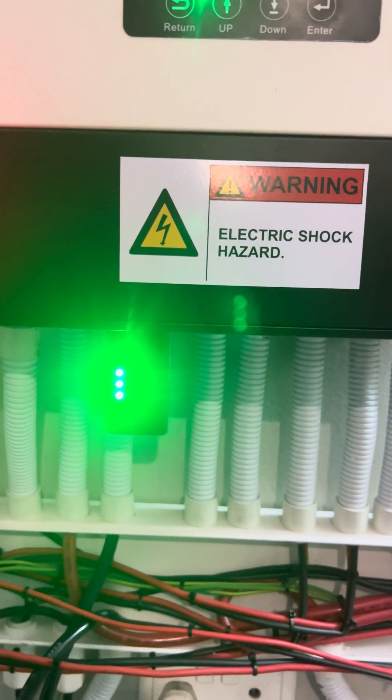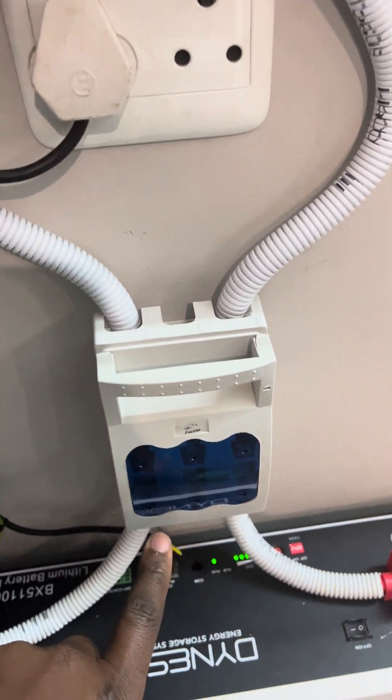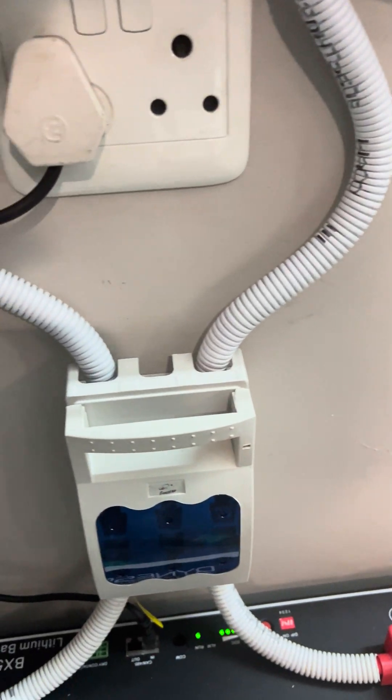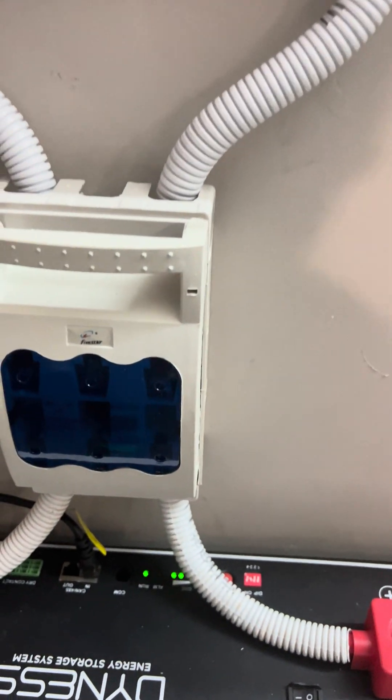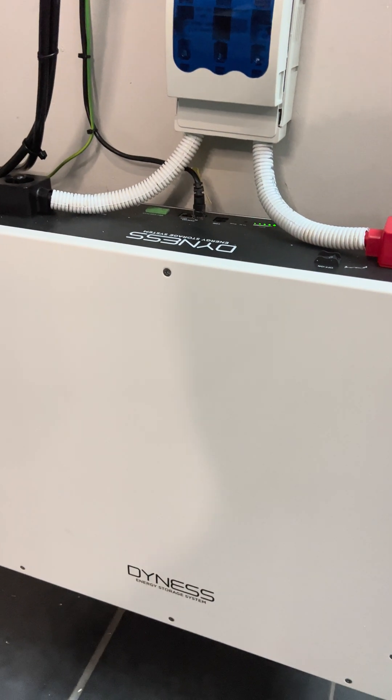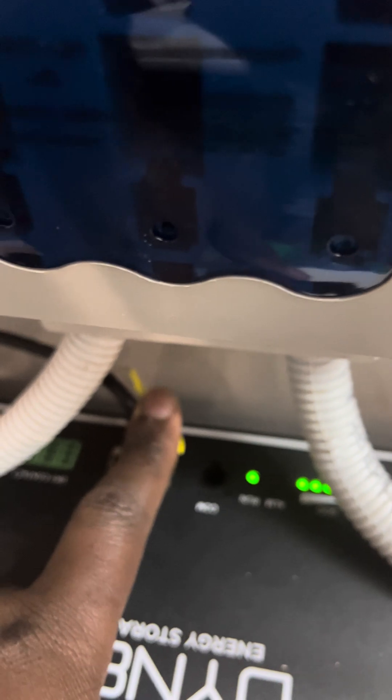Going down to where I'm getting the UPS or the battery from — I've got these Five Star B3 disconnectors with two fuses, I think it's 160 amp fuses. We're using this Deye 5.12 kilowatt — that's the model number there. We've connected our communication cable there, and on the DIP switch you can see DIP switch 3 is on. Everything is closed up because we've got kids who like playing in the garage, so they don't fiddle with this.